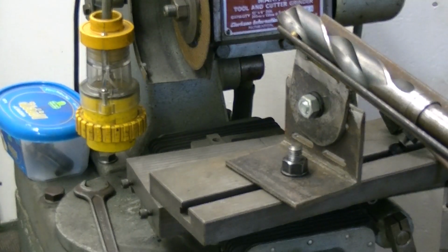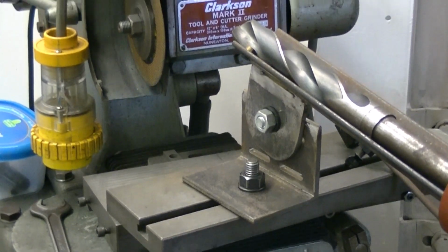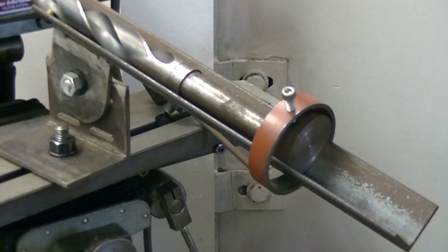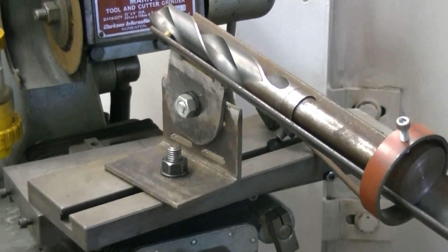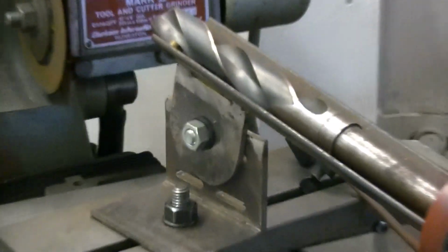Only a few hours working this. Okay, it's just a bracket with a pivot point of a bolt, bit of angle line welded up to the top of it, a piece of rod with a V machined on the bottom as a stopper, and the ingenious part is at the front where I index. Zoom in a little more.